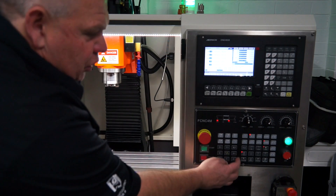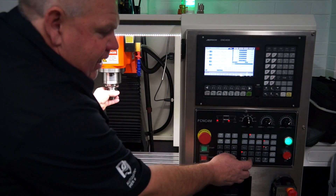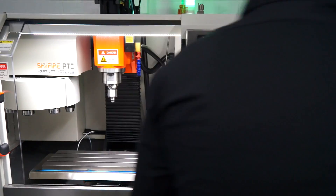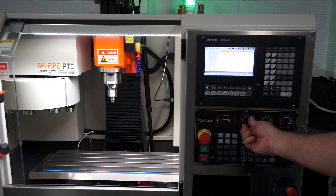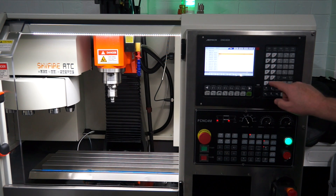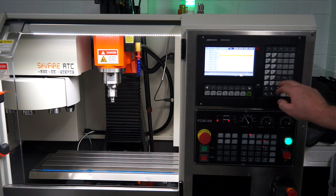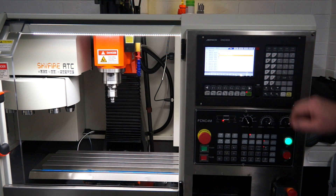Put it back in — of course I can clamp it back up or unclamp it. Line up the little tangs here, clamp the chuck back in. This time we might do an automatic tool change. If I put it in MDI and scroll down — end of block — I can go M06, T05, end of block, and press start. It prompts me to run the MDI, so I press end of block to run it.